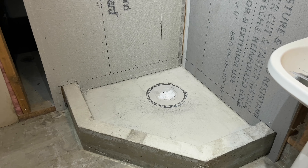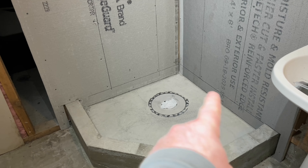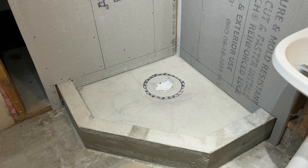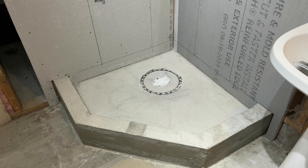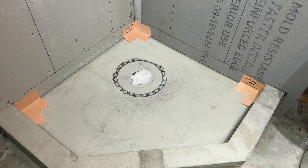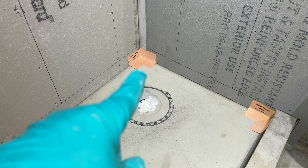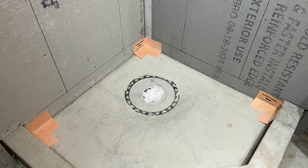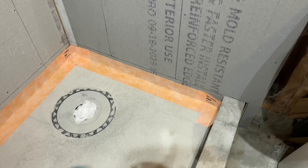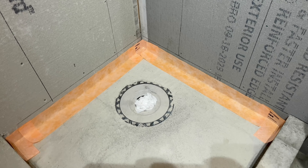I'm going to go mix this outside. After I mix it, I need to wait 10 minutes to stir it again. I need to put in my little corner pieces and measure in between them with my Schluter KERDI-BAND and cut those to length. I've got the three corner pieces just sitting in there, and now we need to overlap each of these by at least two inches. So I'm going to get my KERDI-BAND — we just pulled it off the shelf at Home Depot. We've pre-creased the edge of the KERDI-BAND; other people have said to do that in other videos so we're trying that too.